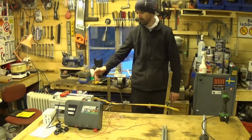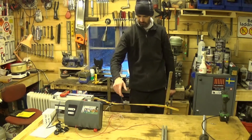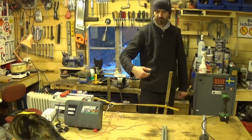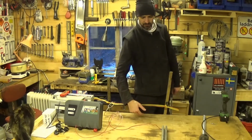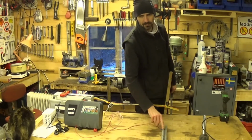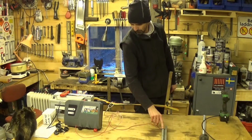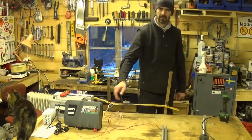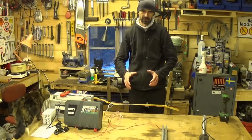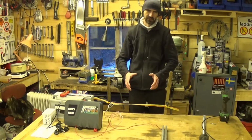So that means that we've got power going from one side of the battery all the way through the circuit, through the Energizer, up here to the fence, through the animal, which completes the circuit, to the ground, from the ground up the ground post, and then back to the Energizer. So the animal becomes a part of the circuit, the electricity passes through the animal, and that obviously creates a reaction in that animal.